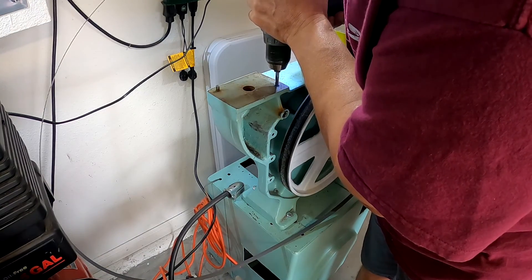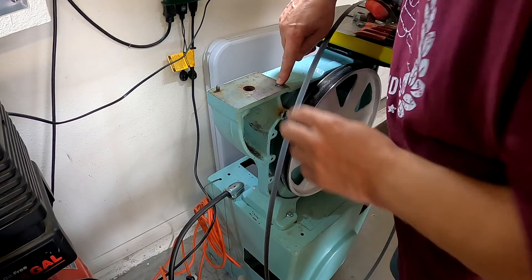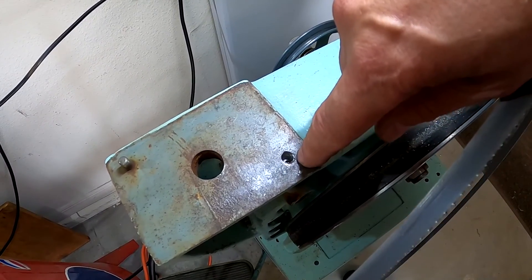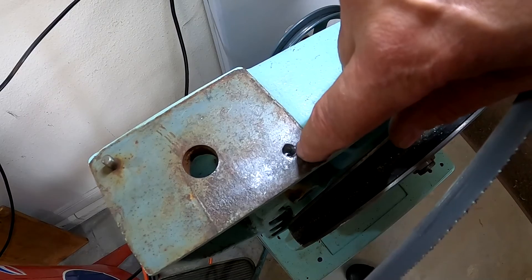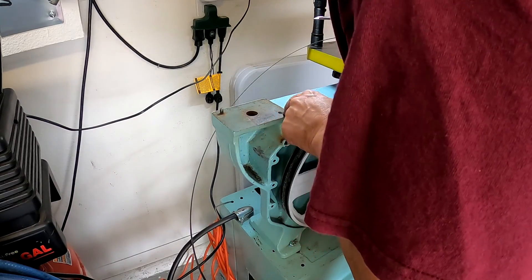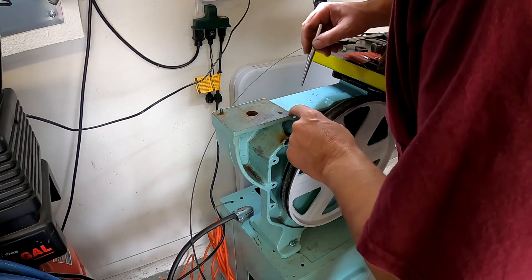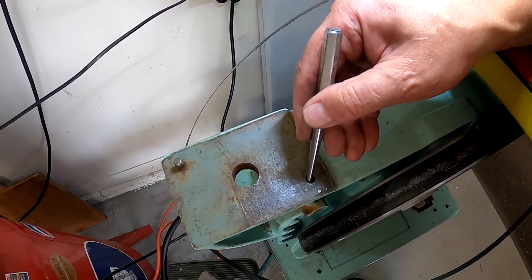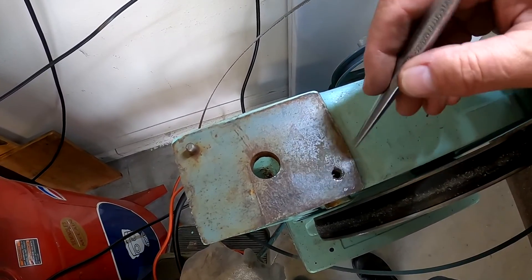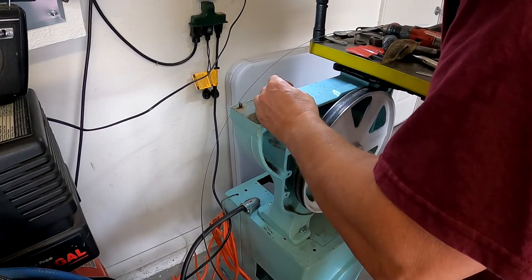My battery's dead but she's doing good - almost there. Switching over to a regular mill now that I'm almost there just to get it flat on the bottom. It looks like I caught a little bit of the casting right here - I can see that right there. That dowel - I'm going to pop that out. Actually it looks like I do have it centered, so that must just be an imperfection in the casting because I can't take it out at all. I even ground a special chisel for that. Anyway, this is all clean - let's pop this new pin down in here.